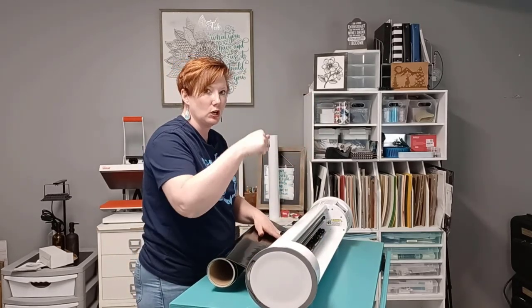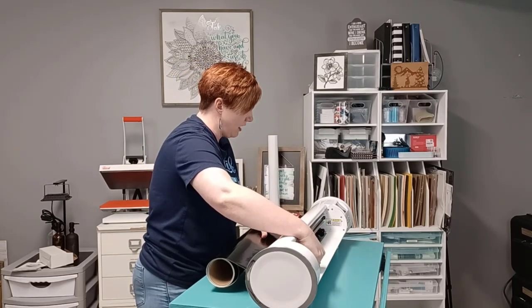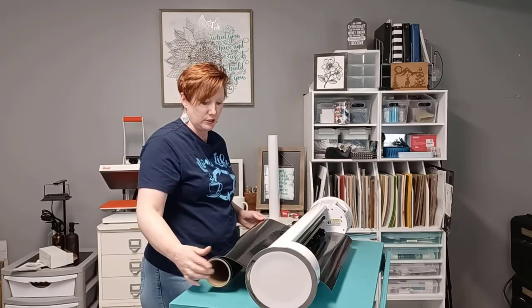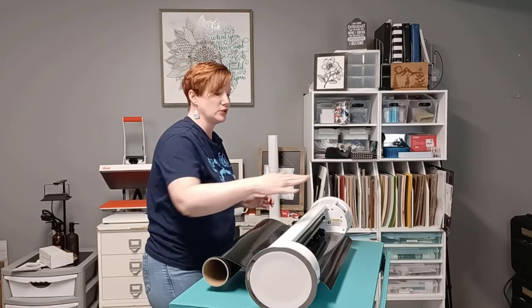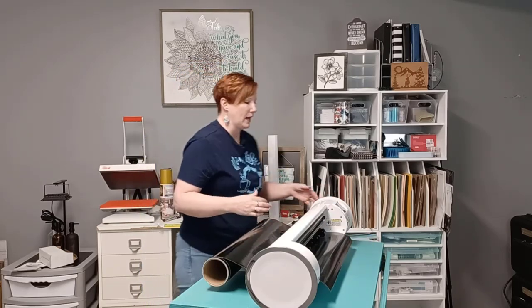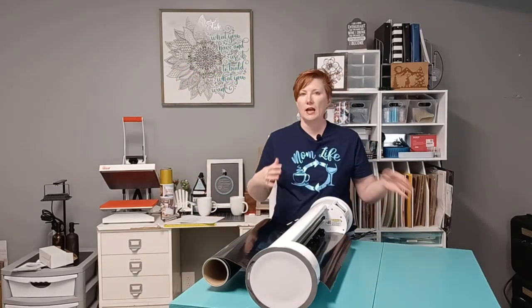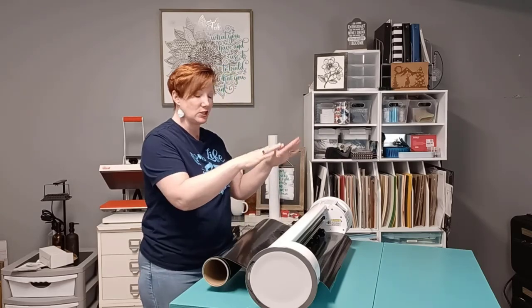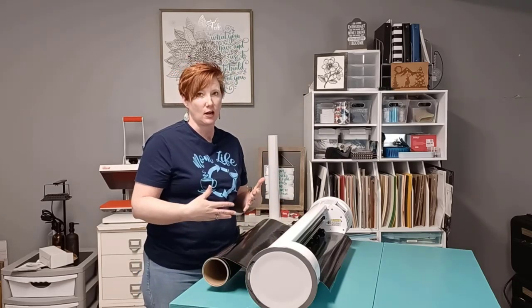The lip or the curl on the vinyl can affect how it goes in the machine. There's a definite curl on that material. That can affect your feed. If it catches, I have it catch on the edge when I extend my feed table here. It hasn't affected the skewing of my cuts, but it makes a terrible sound. And it could affect how my vinyl is fed. Anything it catches on. Curled vinyl is a bad enemy. It's not a machine fault. It's the material that you're using. If it catches on anything, whether it's on your table or in your machine, that causes a problem.